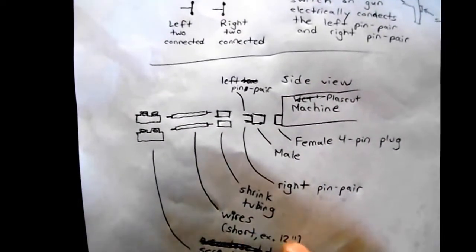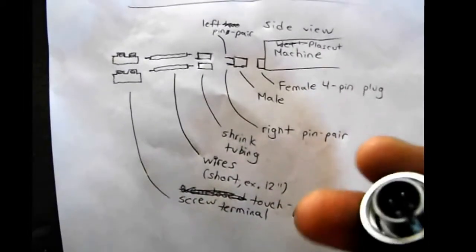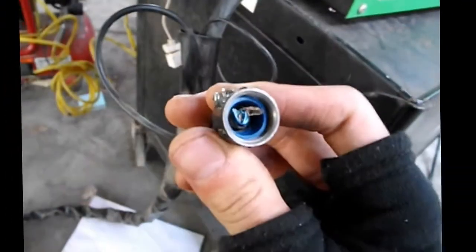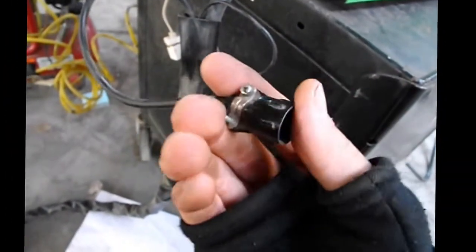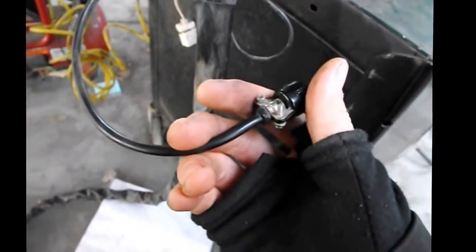Keep the wires short — about 12 inches. After the wires comes the good part: insulated screw terminals. This makes the setup very versatile. If you have the gun and the two wires coming out of it, just screw those wires into the screw terminal instead of using the original connector. Do that and you have a fully functioning plasma cutter with the gun's switch enabled.